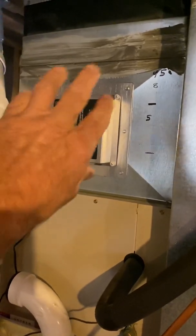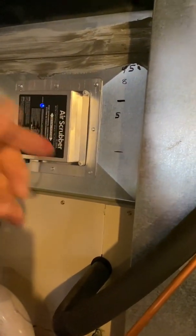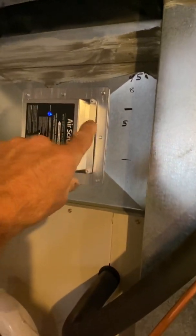Also, while I'm thinking about it — this blue light. You're going to take it out; it's not going to fit back on the supply, but you can put it on the return. Just put it high so it's above the humidifier and doesn't have moisture going over the light bulb.